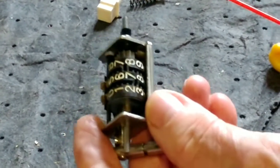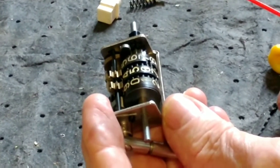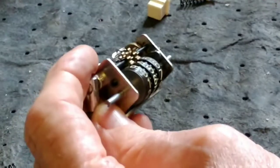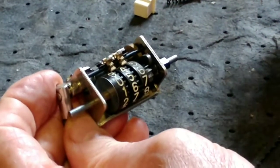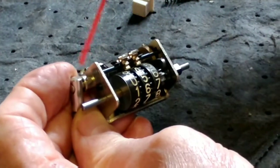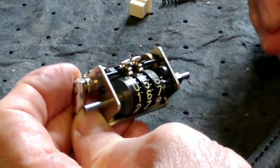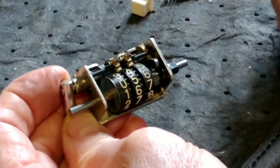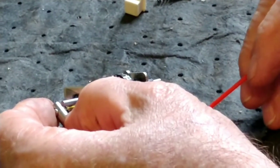So if any of these parts is damaged beyond cleanup and use, where would a person go looking? They aren't available from the original source, I promise you that. All of these springs and the roll pin are standard items. You just have to measure it to know the length and the diameter. And what kind of a supplier is going to carry them? Fastenal is my favorite go-to spot. It's a hardware item, but not a neighborhood hardware store nowadays, or Lowe's.